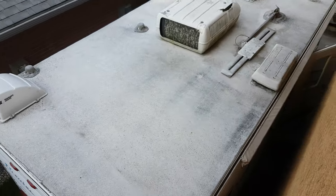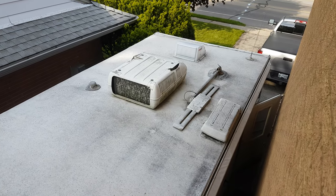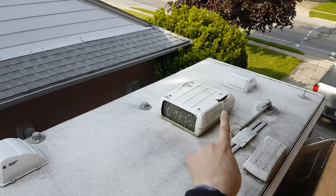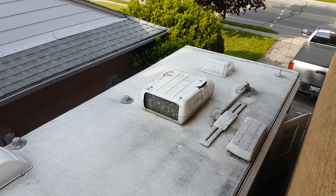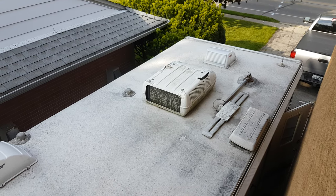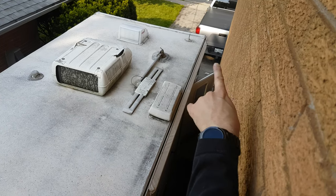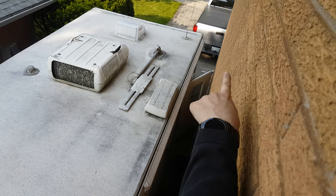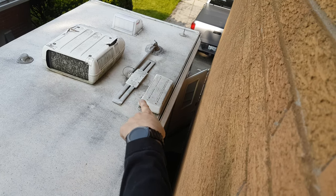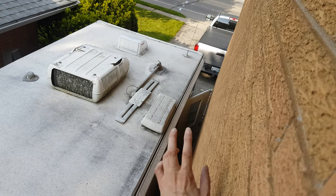There's a bit of mold and some kind of a leak. I checked all the grout lines yesterday and didn't see anything obviously wrong with the grout, but you can see here there's a crack — it's been repaired, but it's possible that's where the water is coming in. The wall right here by the door is soft up and down, so I suspect water is coming in there. I'll probably have to rip out everything to find out where the problem is.